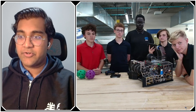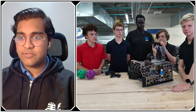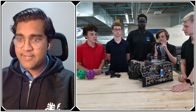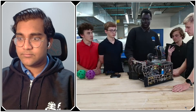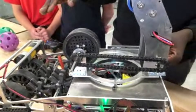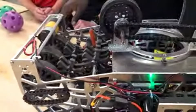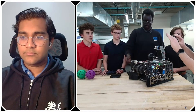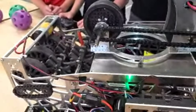Last question is about the turret — you have it aiming very accurately throughout the entire match using geometry and pinpoint odometry. As far as drift is concerned, has that been something you've faced? Our drift is very small because the pinpoint does a very good job at making sure drift doesn't accumulate too much throughout the match. But just in case drift becomes too much, we have a rehoming button on driver one — used if we get shoved or one of our odometry pods goes out. We press the rehome button near the center of the field to rehome the turret and make sure it's facing forward.